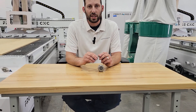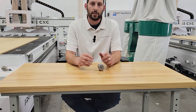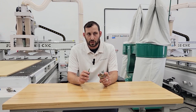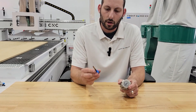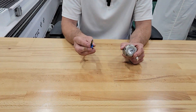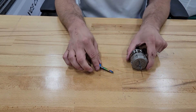One thing that's hard to figure out, especially as you're starting your CNC router journey or even if you've cut a lot before, is when to make the distinction between an o-flute and a straight bit. This is almost always relevant in plastic or aluminum — you don't often see this in wood. Typically, an o-flute is going to be the most advertised way of cutting plastics and aluminum, and it does great: it gets chips out of the way and evacuates them well.